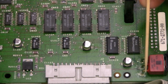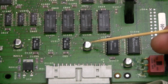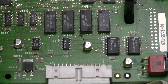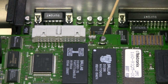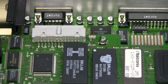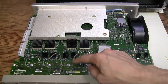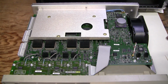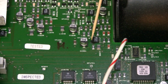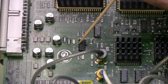So here I see some corrosion around this switch next to this capacitor, and I see liquid stuff from this capacitor on the board and here as well. And check this out. This capacitor is just soaked in this corrosive stuff, which must have leaked from this cap. Here is the bottom, and here we see the acquisition board, and this smaller front end board. There are no electrolytic capacitors on this front-end board, but a lot of them on the acquisition board. And I see really bad corrosion here. Can you see corrosion on the pins of this chip here? And check this out. This looks pretty bad.